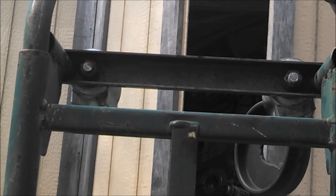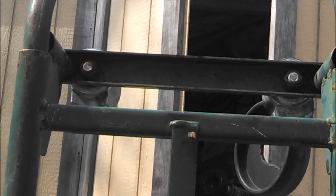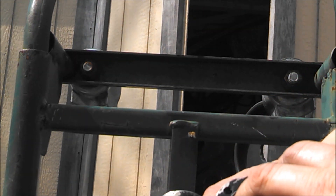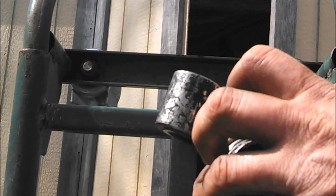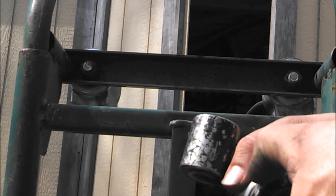On this Alpha-1 Gen-2 trim cylinder, we're going to do a reseal on it. To take these off, there's a spanner that goes in here and will turn it. The last guy that did it grabbed it with a pair of big vice grips or channel locks or something and unscrewed the cap.